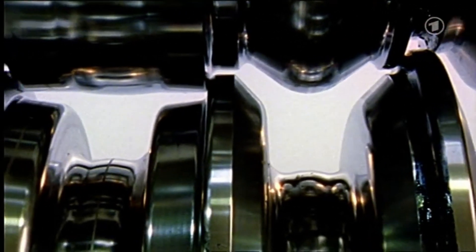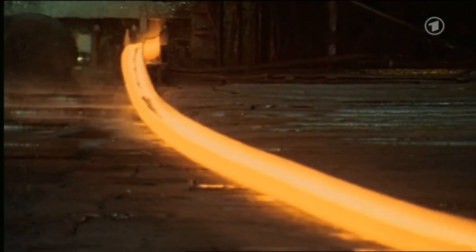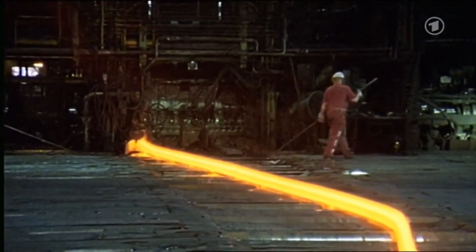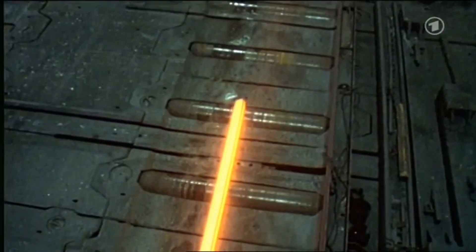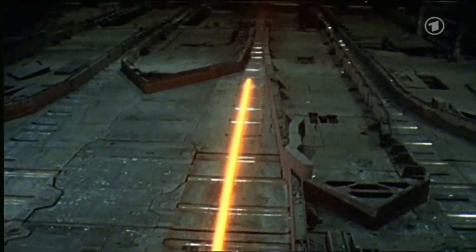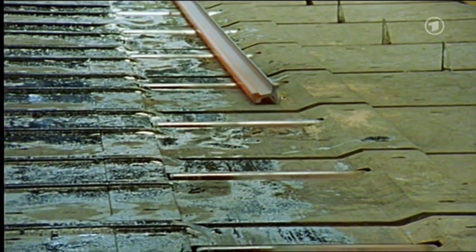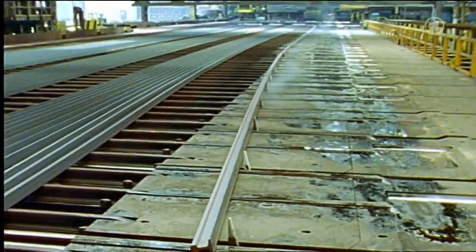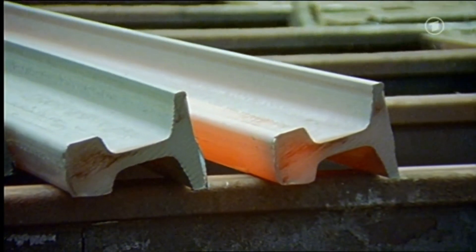So what's it supposed to be? In the end, the steel bloom looks like a T — and that's how it comes out. This hot steel bloom is pushed to the next roller with grippers and runs through there again. In the roller, the shaped steel bloom is changed to the rail shape. After three passes it looks like this. The glowing steel rail has now become really long — about 120 meters long. To cool it, the rolled steel rail runs over these rollers to the grippers, which push it to many other steel rails. Here they cool down, and you can see quite well what it is — it's a railway rail, still glowing a bit.